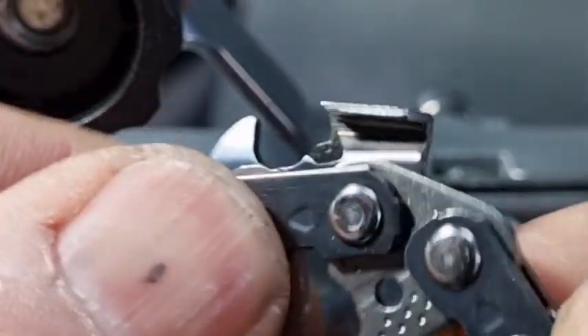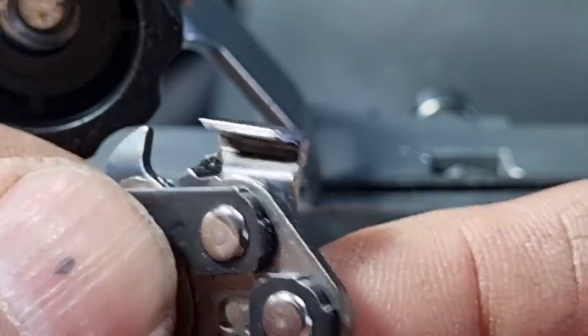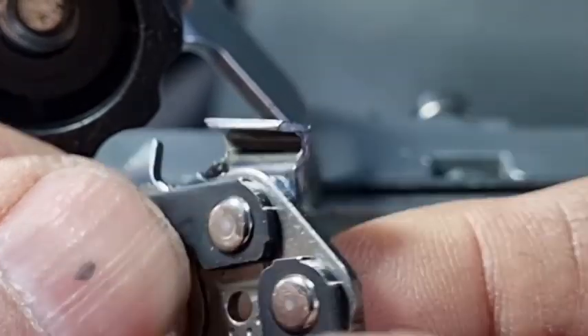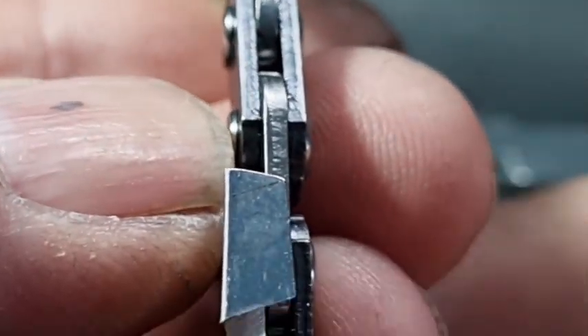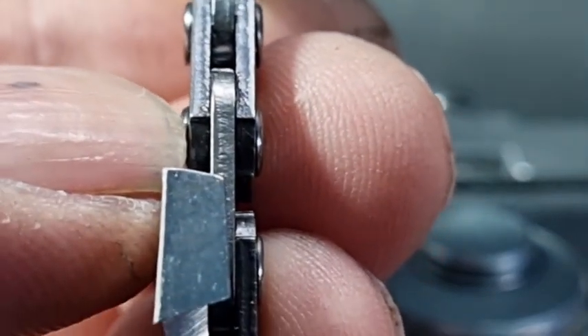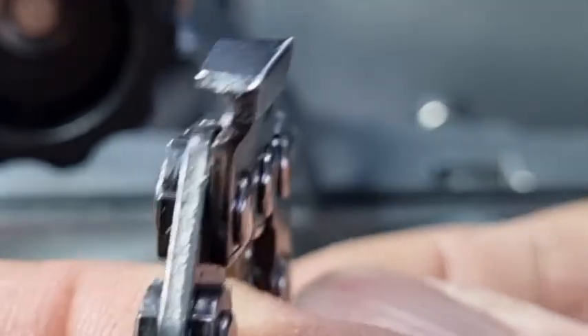That's what I'm saying about measuring — you'll even watch Stihl videos where the guy uses a digital caliper to measure your longest and shortest tooth, but when you've got imperfections like this you're going to get inaccurate readings. Sometimes the shape at the back is different from one tooth to the other — it's close, but certainly not perfect. There's a bit of a curve on it in some cases. There are definitely imperfections, mostly at the back, and those imperfections are going to cause you problems.